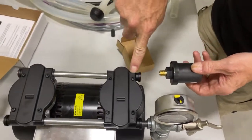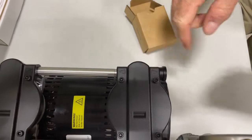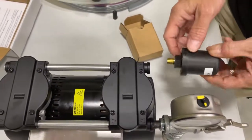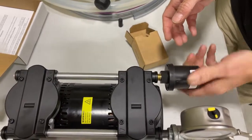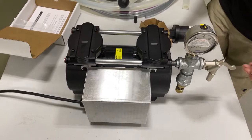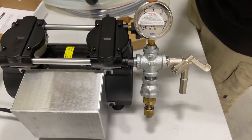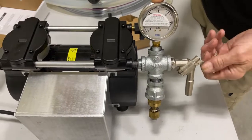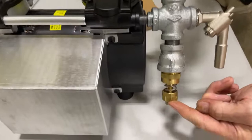Where the casing has an arrow going out, that's the exhaust. The exhaust is this little black plastic piece that comes with it — simply screw it in and that's the assembly of the machine completed; it's now ready to run. The adjustment of the gauge is done exactly as it is on the bigger machine: close the petcock and then adjust using the brass collar on the regulator.